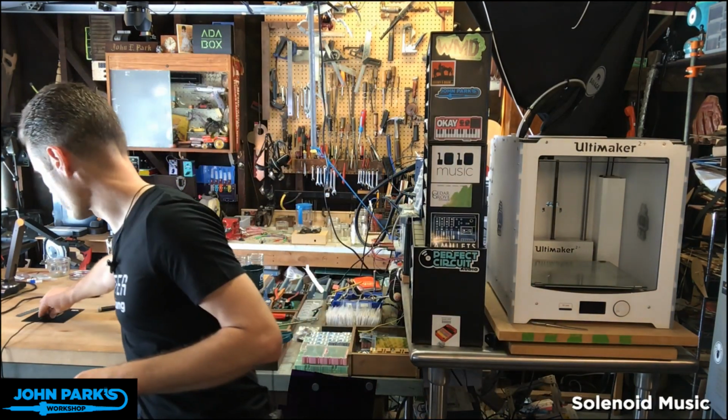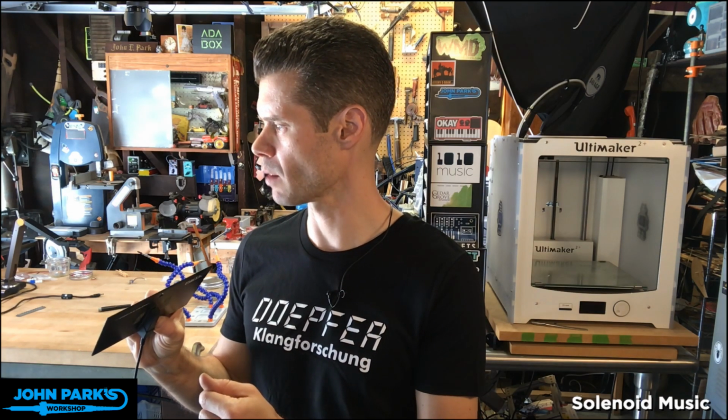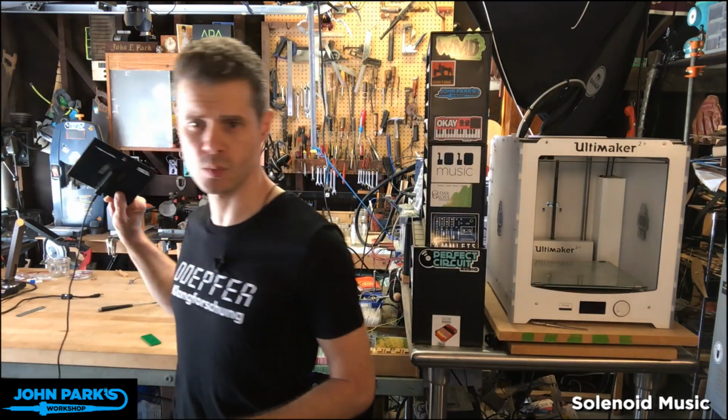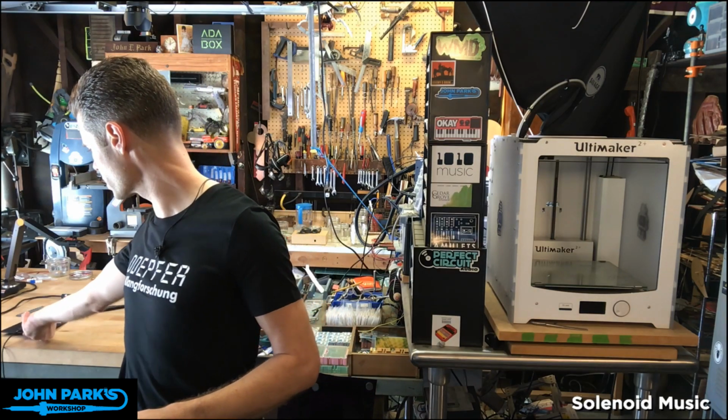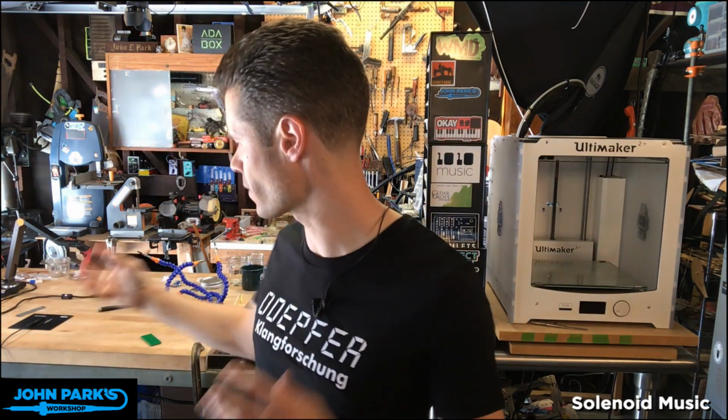I don't want to run the AC because that's super loud, and especially because we're going to be doing some cool sound-based stuff today. Now, you may remember a little while ago, one of my thrift store finds was this pressure zone microphone, this PZM mic that I got, which we think was made by Shure? Gosh, now I can't remember. A real mic manufacturer made this for Realistic, or at least gave them the patent or the rights to do it. So anyway, this thing, I switched this to balanced and put a battery in it, and it works pretty well now that it's balanced. It's not making too much ground noise. Crown, thank you, C. Grover. It was a Crown microphone. I got it for $8, I think it was, or $5, something like that. So anyway, I'm going to use that. I'm going to mix that in at some points to see if that helps us with picking up some of our little solenoid sounds that we're going to make.